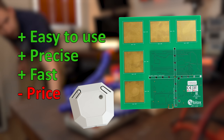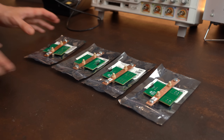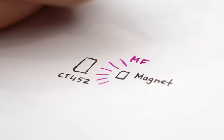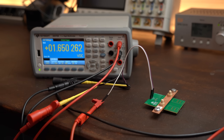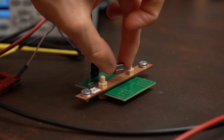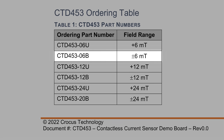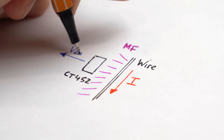Last but not least we have this development kit from Crocus, which after unpacking comes with 4 identical PCBs that have a big copper bus bar on top. Removing that reveals the CT452 IC underneath, which can measure the magnetic flux density next to it and convert that into an analog voltage. When powering the board and measuring its output voltage we see a normal value of 1.65V, which quickly changes when I bring a magnet close. This magnet is complete overkill since its magnetic flux density of 380mT is way too much for the 6mT limit of the IC. Measuring magnets is not the goal — this IC is used to measure current, because current also creates a magnetic field.